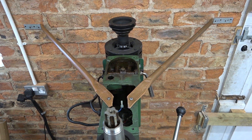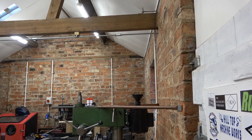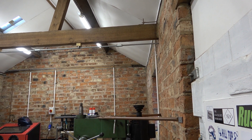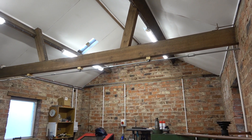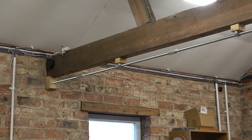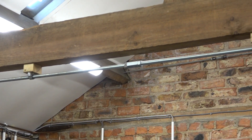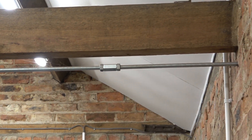So they're both on and they're both level. I've bent the edges down here to make it a bit more secure. Whilst we're talking about the building, this wall to my right is about three inches out of plumb, leaning outwards. At some point there'd been a roof on here which was collapsing and pushing the wall out — I think fitted in about the 1970s. I put the white board on to improve the light. The joists above that are absolutely fine. But I've put on a 16mm threaded bar as a tie rod going right across, which fixes into some wooden blocks on the outside of the building at each side. I think this is going to be fine for many years to come — it just looks a bit scary when you see it.